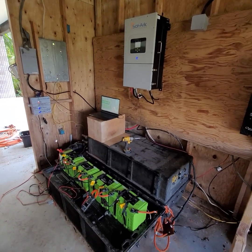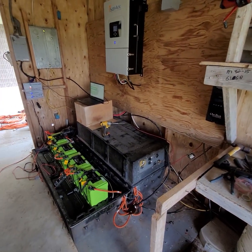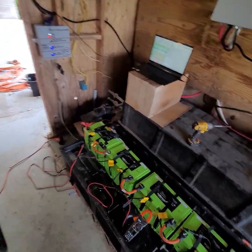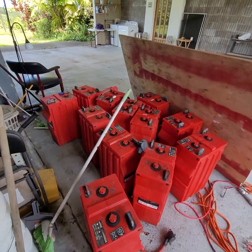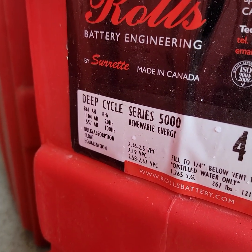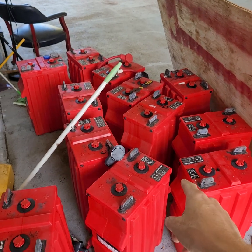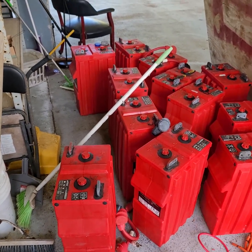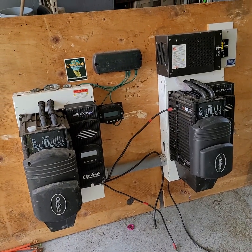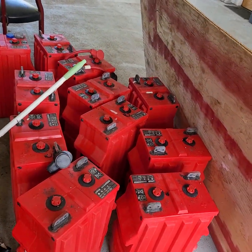So far that's the largest system I've put together — 40 batteries. Previous to that was 38, which I have at my house. I've been using that for almost a year now and I love it. Lithium kicks lead acid's ass. Look at what this replaced — all this stuff. This is heavy, way too heavy. 1500 amp hours, 2-volt cells. If you're going to use lead, this is the way to do it — large single-cell stuff. What are we doing with the old system? It's for sale, $3,500. Comes with the batteries and they're still good. He just wanted lithium.